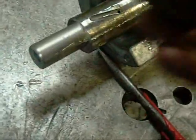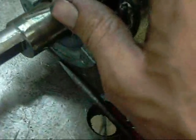So either something's plugged it up, or refrigerant has diluted the oil to the point where there just hasn't been enough oil on that main bearing. And that bearing must come under a lot of load. The scroll putting a lot of thrust load on it as it compresses. Maybe a failed crankcase heater.